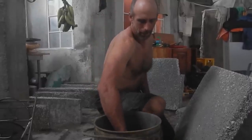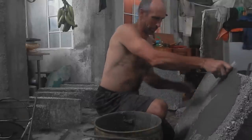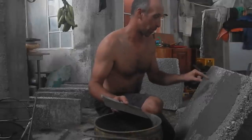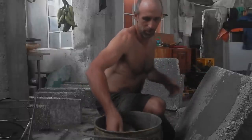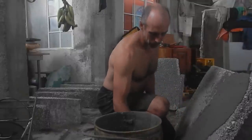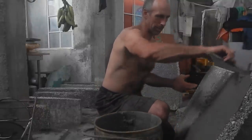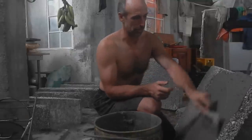Someone's gonna ask about my styrocrete formulation. And I'm always changing the ratios of stuff, you know, just playing around. These are roughly 8 parts styrofoam bits, 1 part cement, and then, you know, enough water to make it do what it needs to do. So 8 styrofoams to 1 cement. No sand, and I'm using no sand because I recently adjusted my styrofoam chewer to make more small bits that I'm hoping will take up the space that the sand would take.